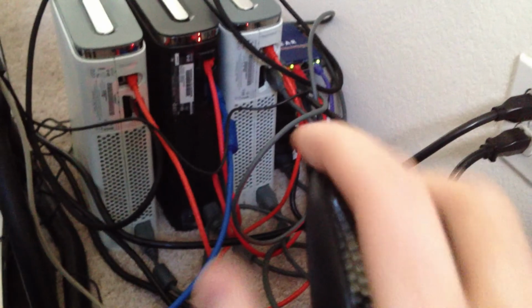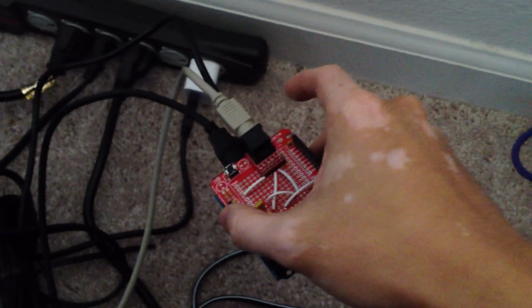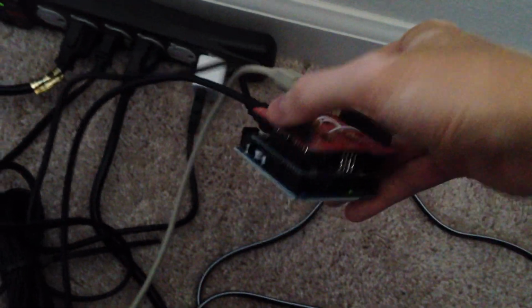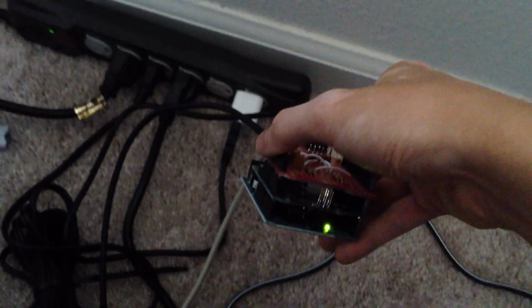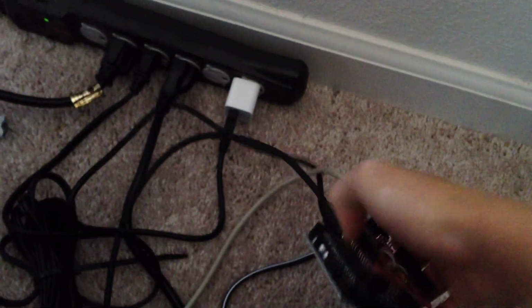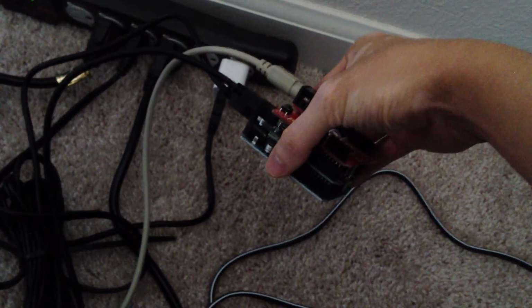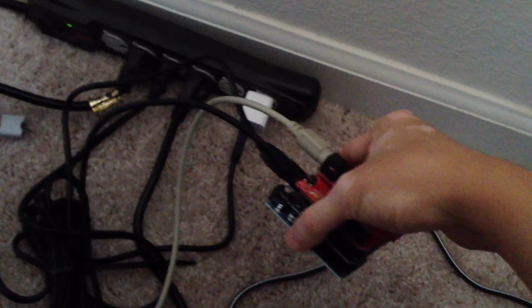I need basically a microcontroller or a processor and something to create analog voltages. And what I did was I used this open source platform called the Arduino, which I hope some of you are familiar with, but most people probably won't be. The Arduino is an open source platform. It incorporates a low power microcontroller, and with a little bit of work, I've gotten this thing to be a very clean way to just translate the USB signal and output the correct voltage.